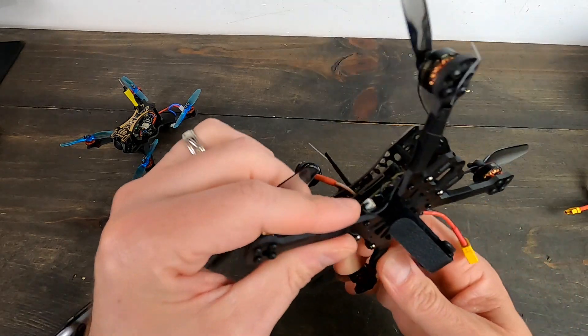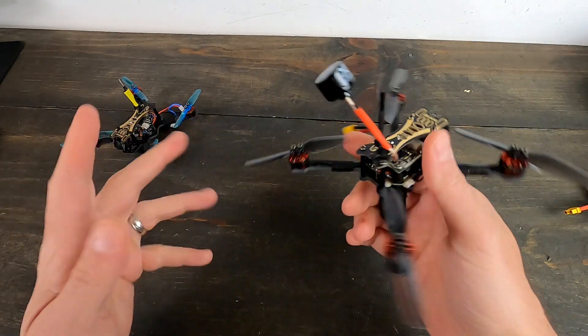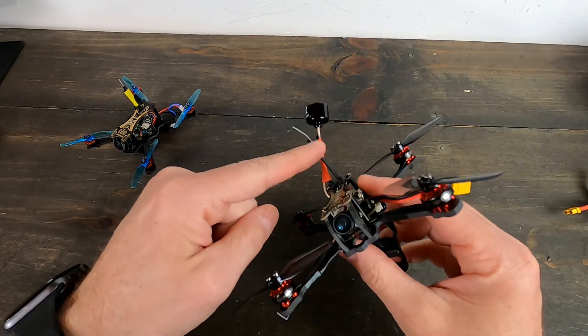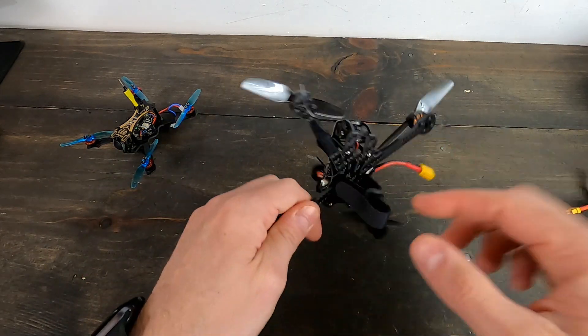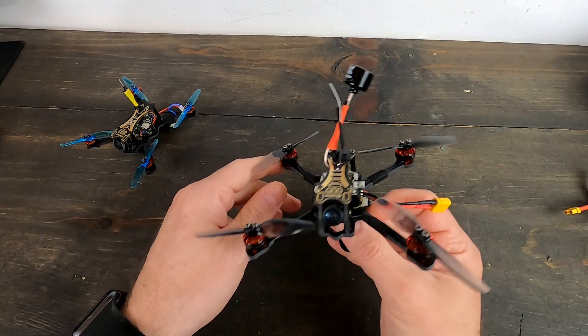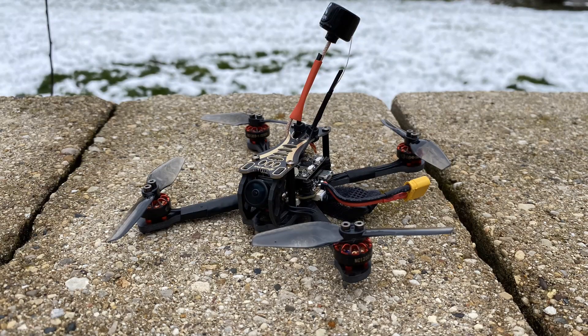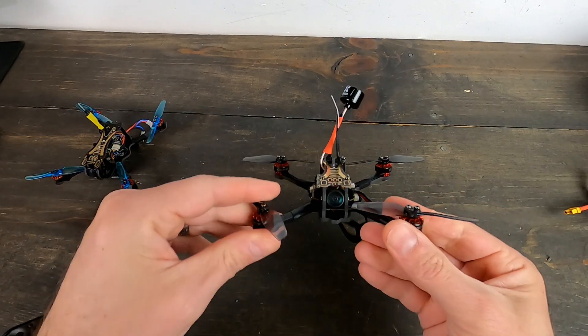The original was a standard dipole like the one on the Novice 2. All the motors are plugged so changing them is easy. The F4 board is an all-in-one with a built-in SPI receiver, and it's got dual diversity — I ran one antenna up and one down, so I've got one on top of the quad and one below. This is a fun little toothpick and definitely an upgrade over the two. The components are really what makes this thing a hit.